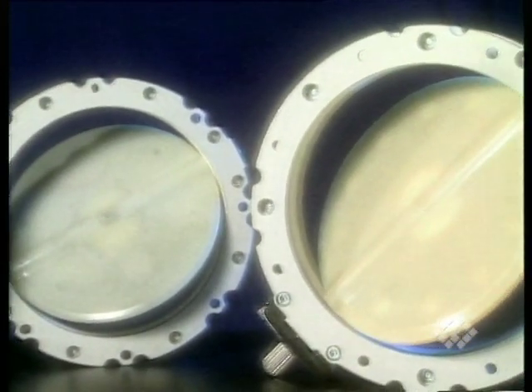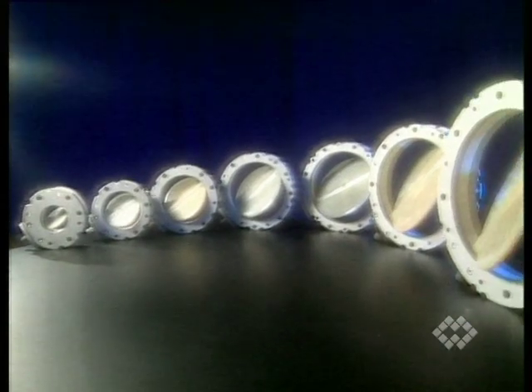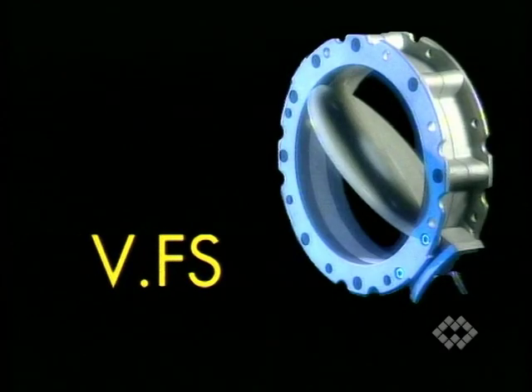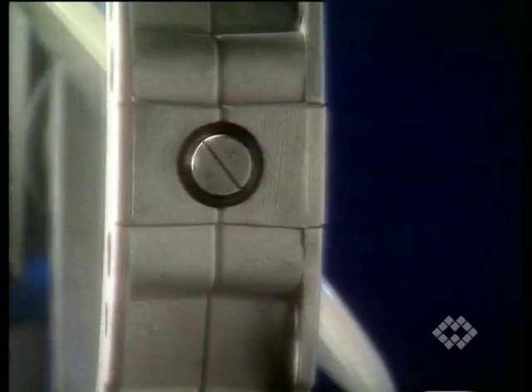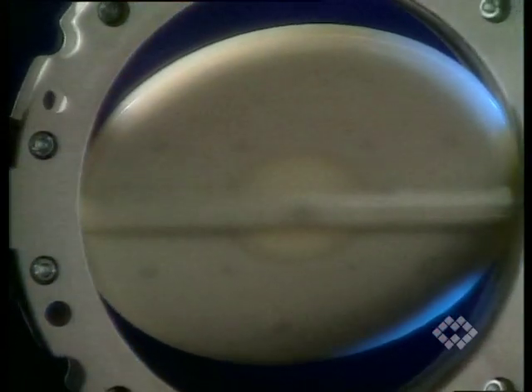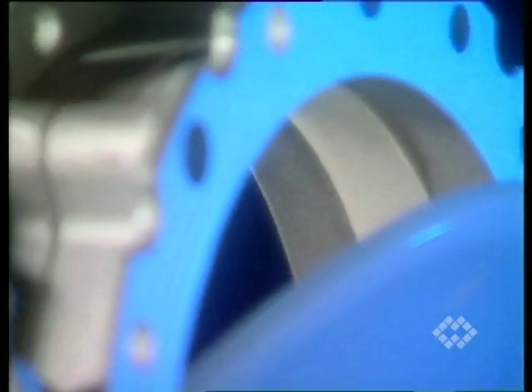Three independent ranges of dust-proof valves are available according to the customer's requirements. The VFS valve consists of two high-pressure die-cast semi-bodies made from aluminium alloy, a steel core disc coated with WAM's unique polymer composite Syntel, and a pre-tensioned elastomer seal.